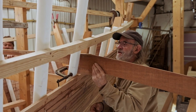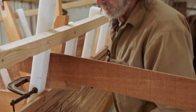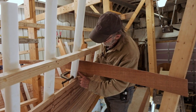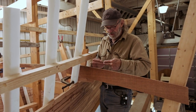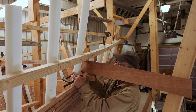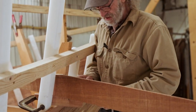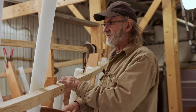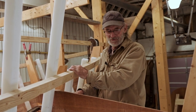So as we do this, we're putting a little block on our mark on the frame, setting the deck timber pattern on top of the block, and the deck timber pattern adjusts the block to the right angle. Then we move the deck timber pattern out of the way and make a quick mark on the side of the frame. That's the way it's done. We have every frame head from one end of the boat to the other — about 42 frame heads on each side — so we better get at it.